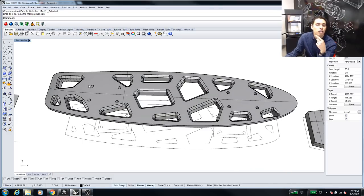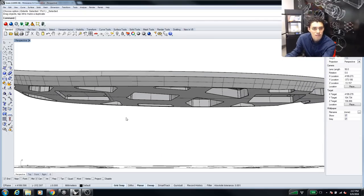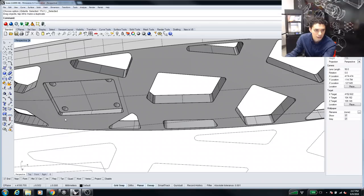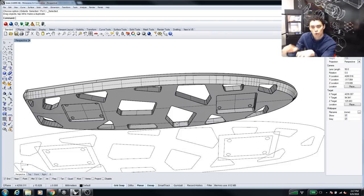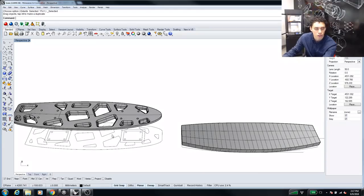And I started at this point, as you can see here, adding the four bolt elements where the trucks are going to be tied into, right? But here at the bottom, also adding a little bit of a carve out for me to be able to nest the trucks, so that the trucks would have a very secure location and attachment to the board. And that one worked reasonably okay. We'll get to the videos of how it worked in a second.